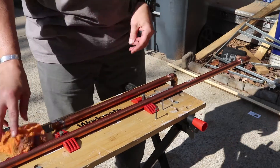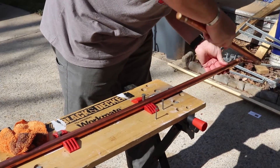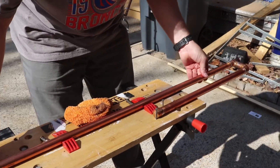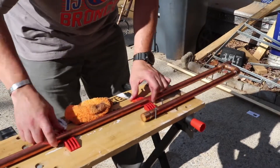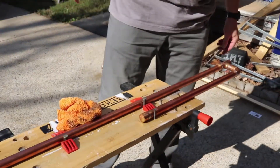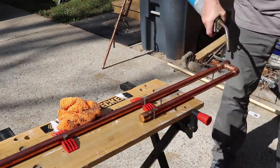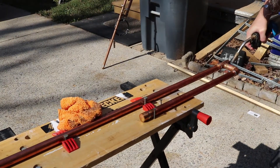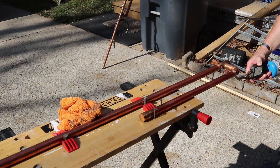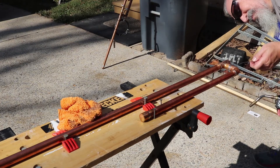Here's where I used the table to keep the two in alignment. In between those is, of course, the 1 and 3/4-inch piece. By laying them on the table like this, that keeps the long piece and the short piece flat on the same plane so they don't get out of alignment with each other. There are just little spacers that I use — those orange dog ears just aren't tight enough to hold it. Here I'm heating up the components, then we'll slap the solder on. That's the tee and the elbow with the 1 and 3/4-inch piece in between the two.